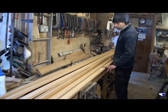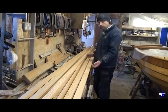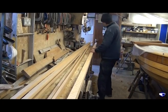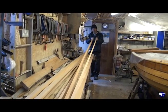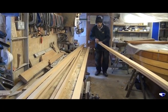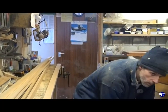We've got at least one good face on each piece, and this is going to be the face that we're going to work on with the router — put in the little keyhole slot, half in one piece and half in the other, then sandwiching them together. Those don't seem too bad as a pair. Just mark those up so we know which bits we're working on.